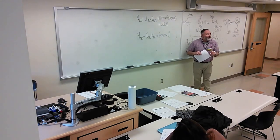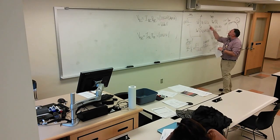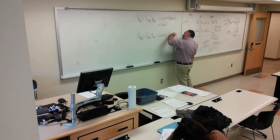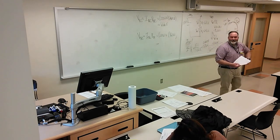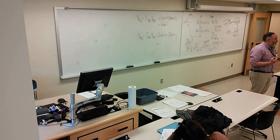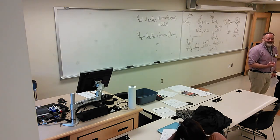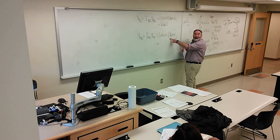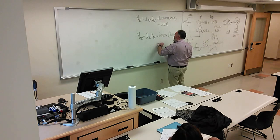What about the resistance A to C? We already said that, right? Because we did this guy, 36,000. Add these guys up. Why? Because it's the same as a series circuit. Does anybody have a guess as to what this answer is without even calculating it with a calculator? 10. Okay, where'd you get 10? It's flowing through the whole circuit. If someone punches this through their calculator, do you get 10? It's 9.999 because of round-off errors, but really it is 10.